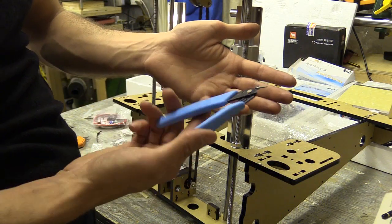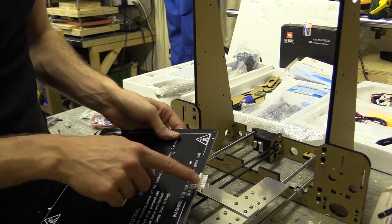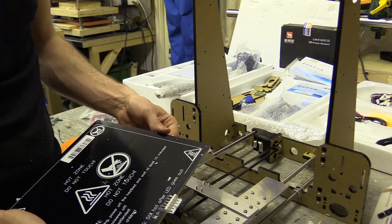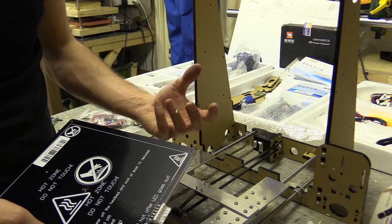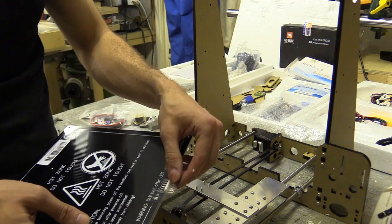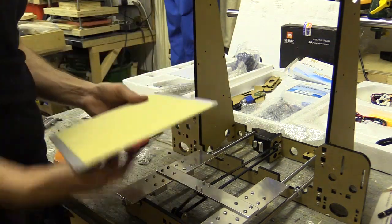I've just managed to break the snips that came in the box. I did do a bit of research about this machine and one of the things I noticed was the contact — the terminal here, the plug that fits onto it — is a well-known point of fires. What I may do is use shielded terminals, maybe even get some fiberglass shielding or sleeving, which I can cover the wires with after I've soldered them directly onto the terminals. I'll save that for another time.